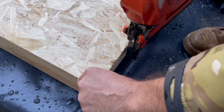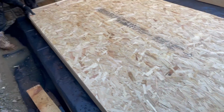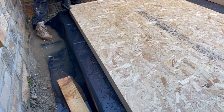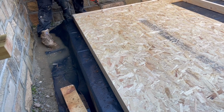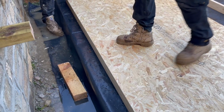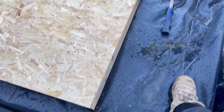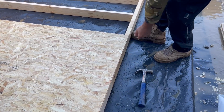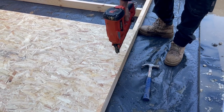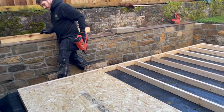John, who's resisting? Not me. I'm just going to push it in a minute. Right, and then John's going to straighten it down that leg there. Are we good? Yes, perfect. And what we'll do, we will fix down that side, and then to get it square, the sheet is square. So we're going to put the frame square with the sheet. And when we do that all the way along, that means that wall will be square and plumb when we put it up.